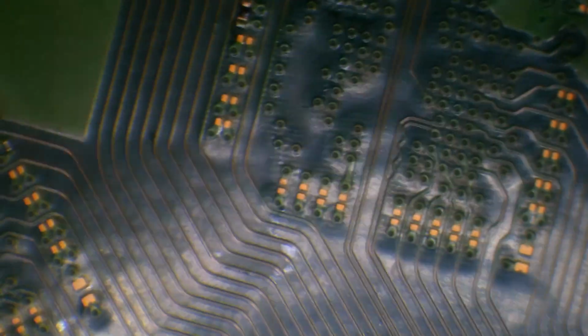The only thing that I can really find that could have potentially caused it is going to be this. There is not enough liquid metal on that APU. And if that was running for a good hour and then it just randomly died, it could well have overheated itself to death. I'm not seeing any spilt liquid metal anywhere.